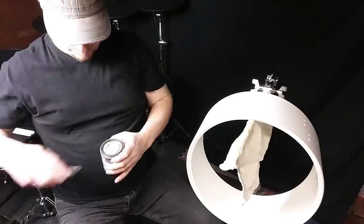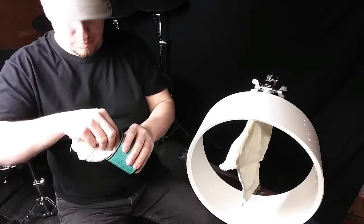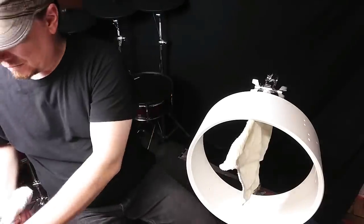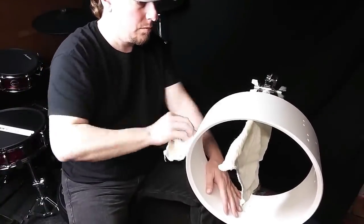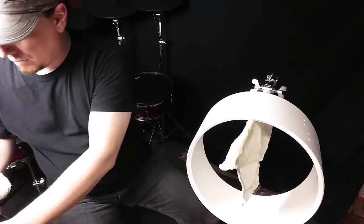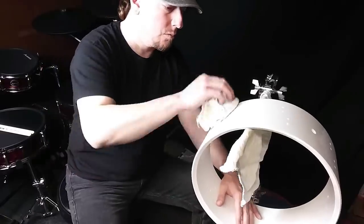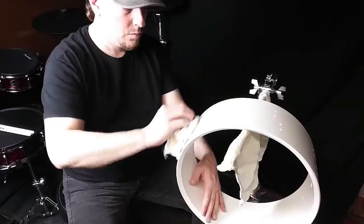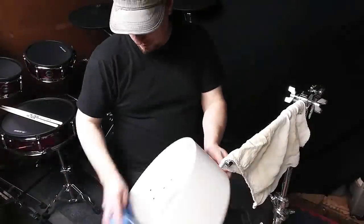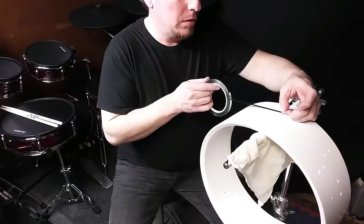I'm also, through the sanding process, basically erasing all of the pencil marks. And now that the sanding is done, I'm putting a very, very thin coat of polyacrylic, which is just a matte finish acrylic. And the only reason I'm doing that is to protect the shell from getting dirty and fingerprinted. It's not in any way meant to enhance the finish. It's a flat finish anyway, and this is what it looks like. It's just a flat, and I'm letting the white of the PVC shine through.